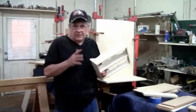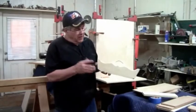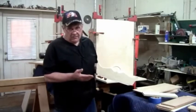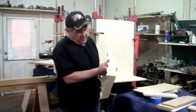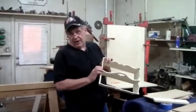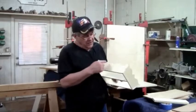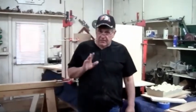They're not hard to make. They've got some peculiarities, but if you look at it, it's basically just a drawer except it's on an angle. That's primarily the reason I wanted to do this — to deal with the angle and dovetailing it. These are cut on a 15-degree angle, which is a fair amount of splay, but it looks pretty good. The center is put in with a sliding dovetail right here. This is just my poplar mock-up, but when I'm done it won't be a mock-up anymore. Crystal said she wanted to paint some flowers on it, and we can do that. Let's get a new camera angle and look at some of the dovetail work.